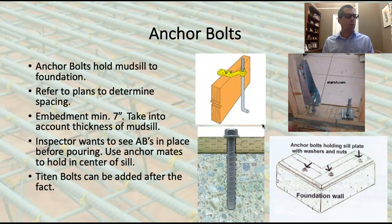I've done it in the past where we were pouring concrete and someone would go along measuring out and setting anchor bolts in place. Invariably, two things happened: about three-quarters of the way through, the concrete started getting too hard, so we were hammering anchor bolts in with a sledgehammer — all that does is plow through the concrete and leave a big void, so it's probably not holding the anchor bolt at all. The other thing that happened is that in the panic, we'd make mistakes about where the anchor bolts were supposed to be placed, and we'd end up with anchor bolts in the wrong place.